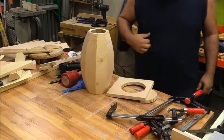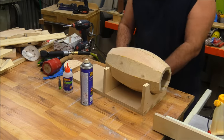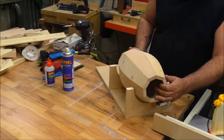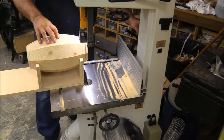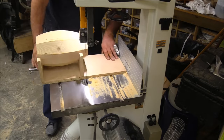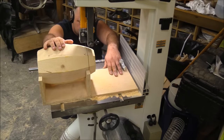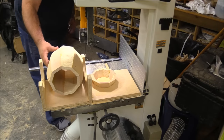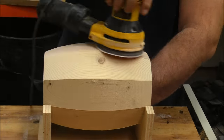All the joints looked good. The next thing I needed to do was create a saddle that the barrel could sit in, so I could use it over on the bandsaw to trim off each end. I used some scrap plywood, cut a round out, and set the barrel in there so it was level, then ran it through the bandsaw. I raised the bandsaw, got the fence and blade protector up, then used the sled to follow along the blade. I looked down below the piece to keep the blade tight up against the two vertical stanchions — that kept a pretty accurate cut, and the miters were flawless.